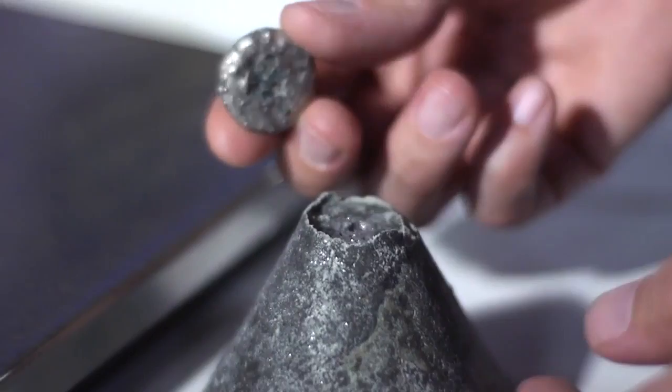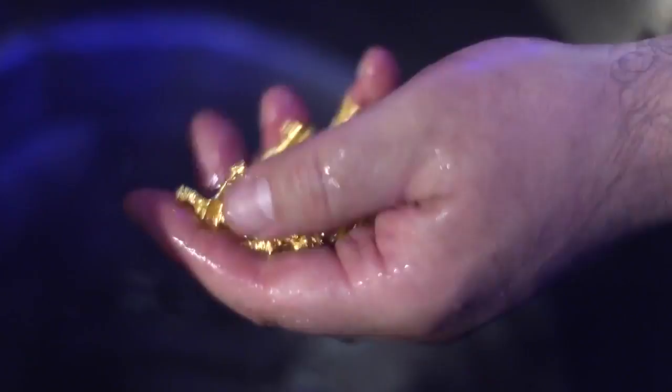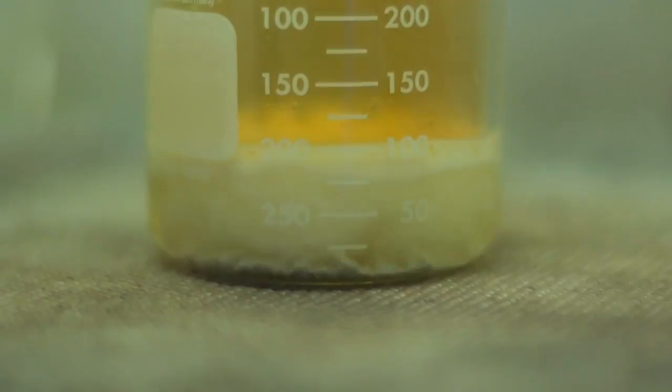You can then easily separate the metal button from the slag. Once the whole lot has been melted and sampled, it's remelted and recooled into grains about the size of BBs in order to speed up the extraction process. The grains are then placed into a mantle where an acid solution is used to dissolve the metals into liquid form.